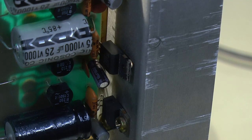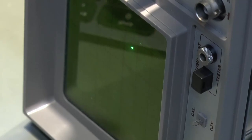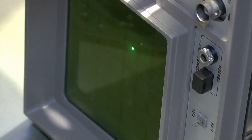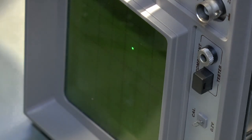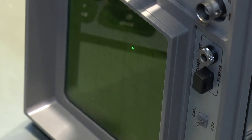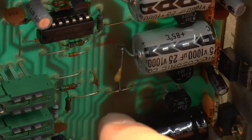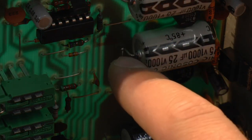There are also some other parts which might be hard to take out — you'd have to remove some of the front panel connections and switches. So I've decided to leave that fun for when I recap the rest of the unit. For now we're going to put it back in and see if it works. I left this unit off since installing the new cap, wanting the camera on it in case the cap blows up. Plugging it in — the unit is now on. It's not starting to move or bulge — a very good start. And check this out: we have a dot, and it's actually rather tight!